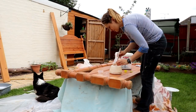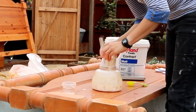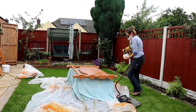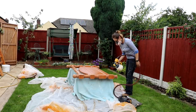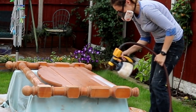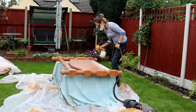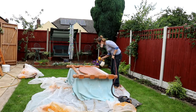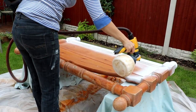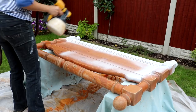I'm trialling this with my Wagner fence and decking sprayer. I've never spray painted chalk paint before, so it's going to be a test. But I know from lots of other shabby chicers that spray painters give a texture that's smooth as a baby's bum, and I needed the job done as quickly as possible. I'm not sanding the surface as I know chalk paint sticks. I've got rags down, a face mask on, and I absolutely loved how it was applying — the finish was great, quick and easy.